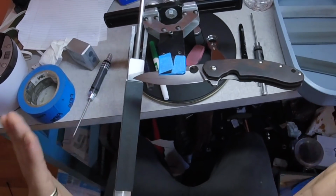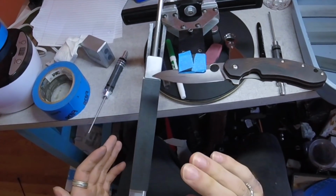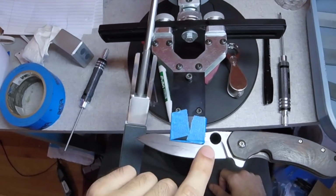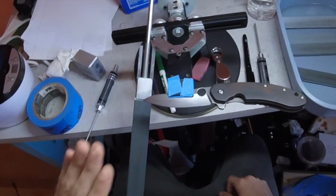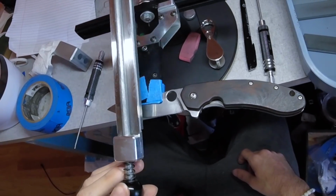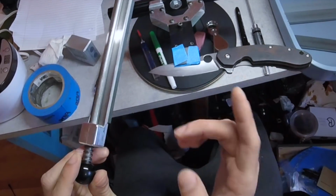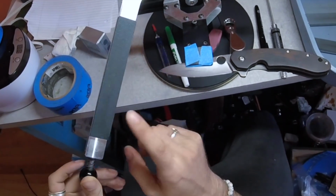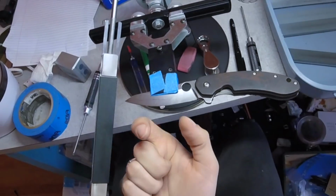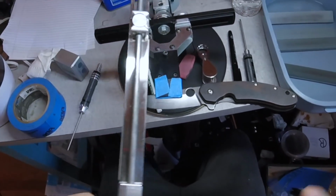I'm not worried about it because I know that's not going to happen here. I'm using silicon carbide. And even if it was, what happens with that is you'll see little stray scratches. Now what you won't see is what people ask about when you're sharpening and then you go way too far. I have it set so I can't right now, but if you go way too far, it'll make about a 1 inch or 1.5, however wide this is, scratch pattern up your blade. If you see that, it's wide, it's straight, that's because you slipped. That's not because of stray scratches. It just isn't, okay?